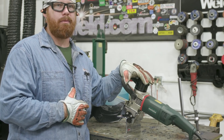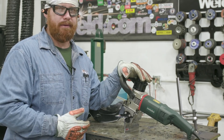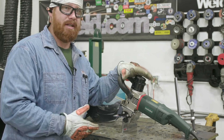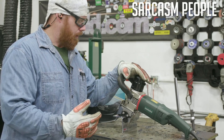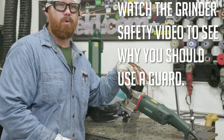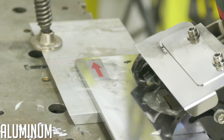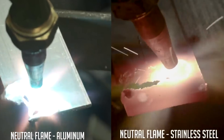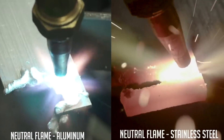For my money, if I had the money, this is what I would pick up because of increased accuracy, increased speed, and repeatable cuts. You could train somebody on this in just a couple of minutes. And it's a lot safer than using a grinder — everybody knows the first thing you do when you get a grinder is throw away the guard, right? I actually can't get my hands into the working components of this tool while it's in operation, so it's going to be a lot safer. It can also cut aluminum and stainless steel, so depending on the type of materials you're cutting, that's going to rule out the oxy fuel setup and you'll be stuck with a grinder or this or some other mechanical process. I would highly recommend going with a plate beveler if you have a lot of beveled plates to do.